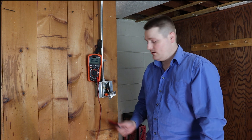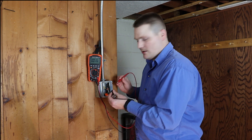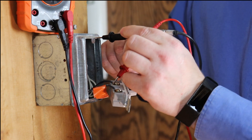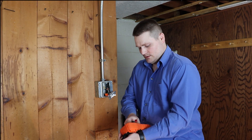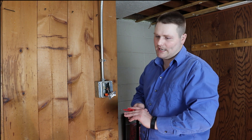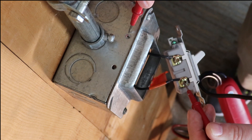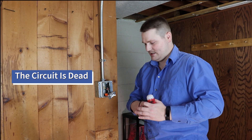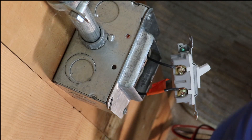Give me a couple minutes — I'm going to go hit the breaker and put my piece of tape on the line. All right guys, I'm back after turning the breaker off. I'm going to come here and test this with the multimeter — you should test it, it's not working. I'm going to ground it out, touch both to ground it out — I don't see any voltage. Now just in case somehow this got fried and stopped working, I'm going to take my other tester. I touch this — I don't hear any vibrating, touch at the ground — don't hear any vibrating, don't see a light. So that means this circuit is now dead 100 percent and I feel safe to touch the wires.